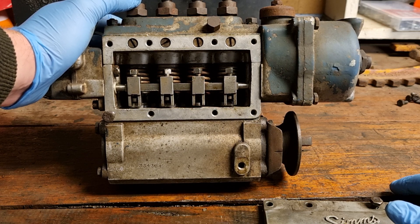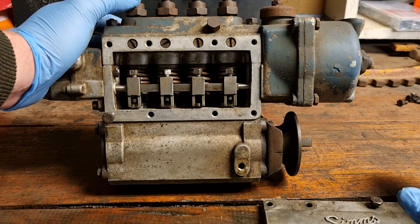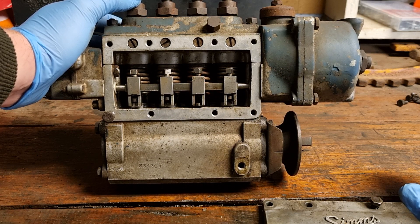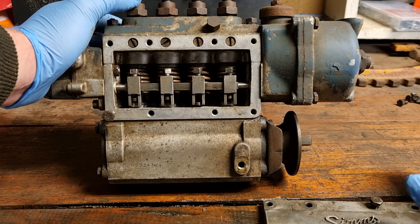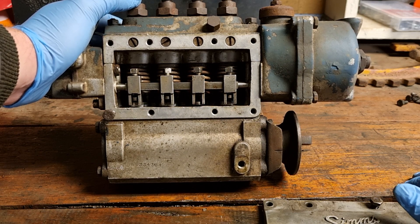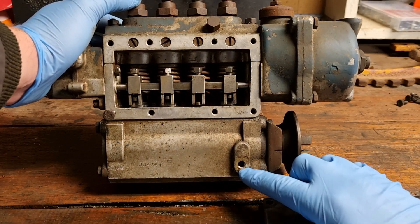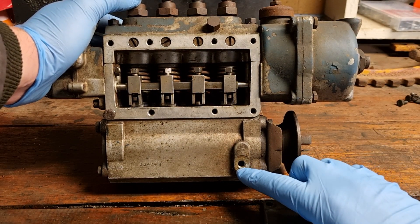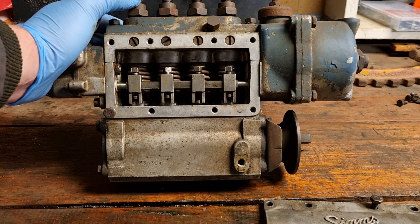Once you've filled it up, there's really no need to touch it unless you notice it's been sitting for a while — it could have dried out or leaked. If it's been sitting on its side, excess fuel could have leaked out. Every couple of hundred hours I like to just take the inspection cover off, see how everything's moving, and put a little bit of oil in there until it comes out the leak-off pipe. That way I'm always guaranteed it's going to be full.